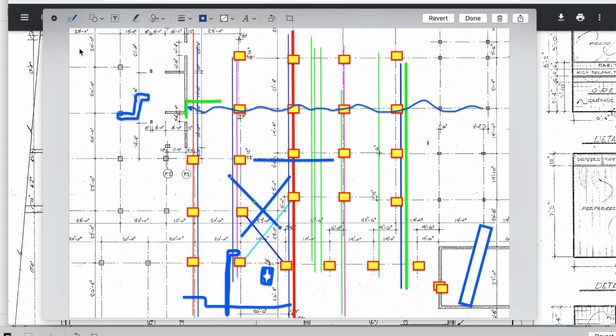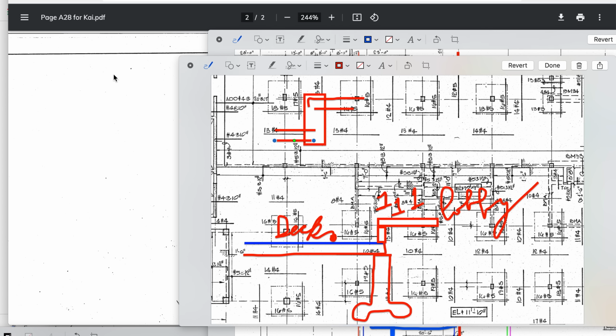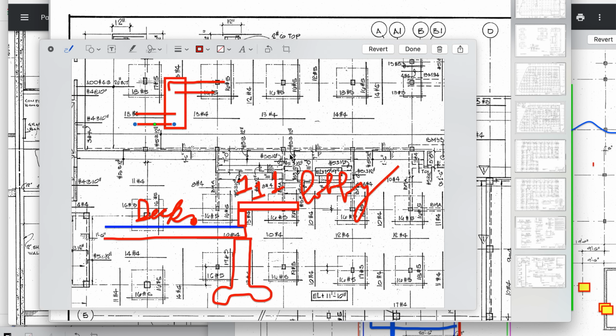So this one they option for the link to go from the bottom deck to the top deck. These shear links, right? They work in tension. And so if the deck tries to fall down, it puts all this concrete in tension. And the resistance is right here for rotation, but also in the column. But it would be there if that tried to fall over the cantilever, because they created cantilevers basically between this section and this section.